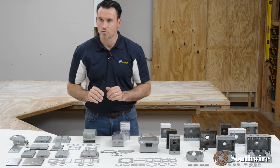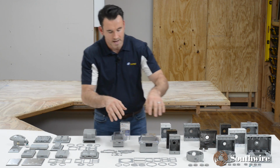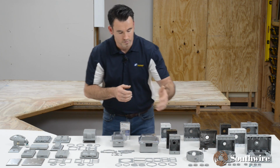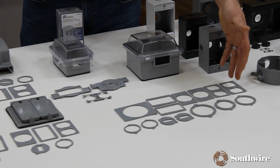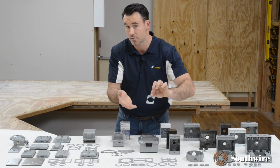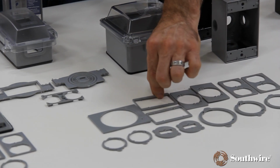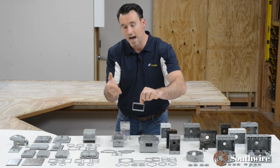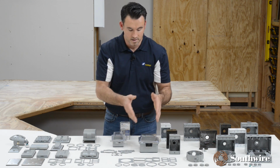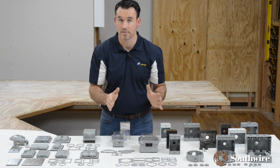When you think about the in-use covers, we have the same feature we had on the universal weatherproof covers. We have many adapter plates that you can choose based on your installation. So if we're talking about convenience, outlets outside that are duplex receptacles, maybe we have a single receptacle because you're going to use it for a circulation pump for a pool. You could have an outside GFI. So you have many options. And that's the key, that you are not locked into one type of device. This in-use cover has many options for you to connect to all different devices.